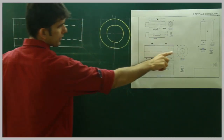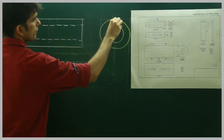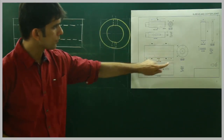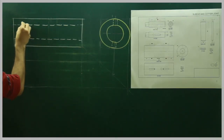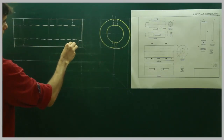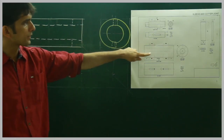The width of the cotter is 6mm as given. So what we will do over here is draw a dotted line - we need to draw it in the front view also. If you see, there are 30mm on both sides, so we can take 30mm from here and draw a dotted line. The other dimension is a tapered one, so we will come back to that afterward.